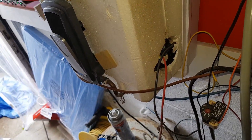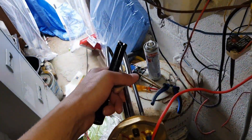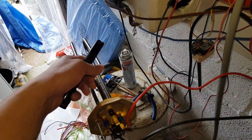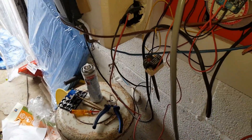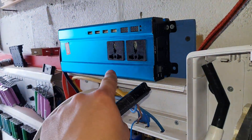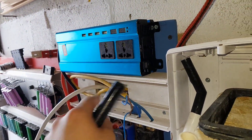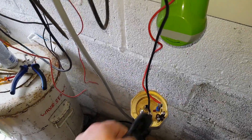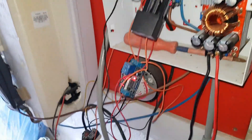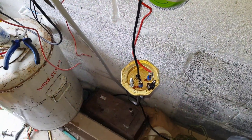We'll be going up from a 2.4 kilowatt element to a 3 kilowatt element. On a low voltage system running at 90 volts DC, we would actually see less current flow, which is not really a bad thing — it just means the duty cycle will be on longer if the sun is out more often. This is not designed to drop the batteries below a safe voltage; that is done by the charge controller next to the batteries. One day we'll be upgrading and using this 24 volt to 110 volt inverter — American voltage — which will give us approximately 4 amps, 440 watts, flowing through a 3 kilowatt element.